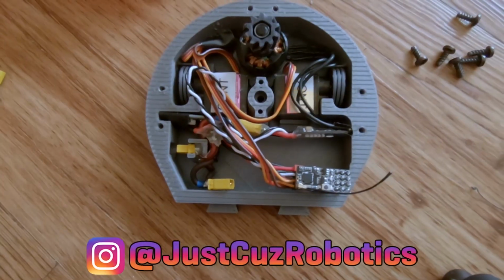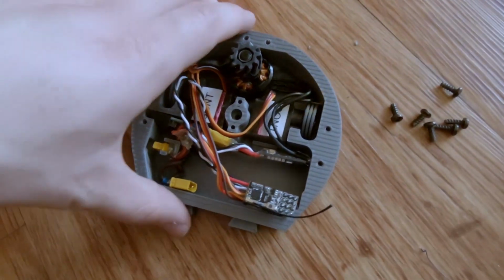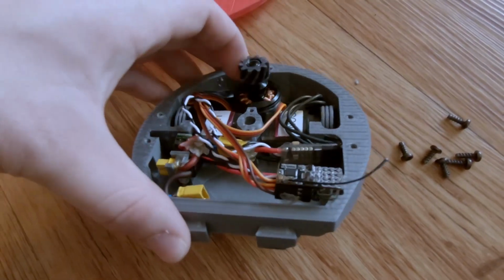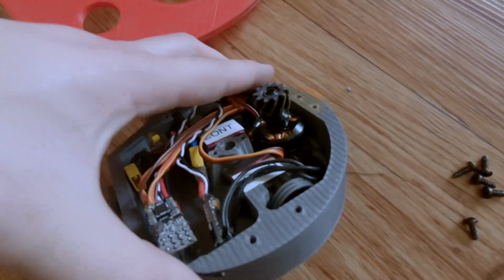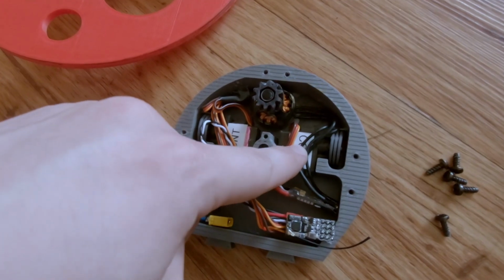on Saturday morning. On Saturday, I began my day trying to fit the electronics in the new chassis, only to find that the wires were all in the way. I cut and resoldered a bunch of wires to shorten the runs and allow them to flex where needed. As you can see, the ESC now has less than an inch of wire before the XT30, and I had to redo the link wiring as well.